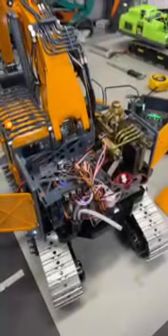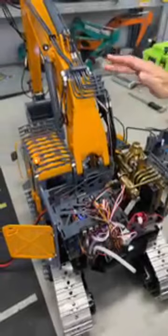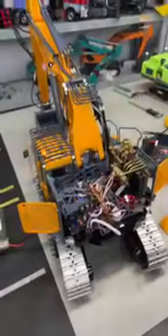Okay, let's see others. The rotation, all the electronics is under this plate. So it is only the ESC. And we have one fan here for cooling it, also one fan here for cooling. Most importantly, what gets hot is the ESC. It needs to be well cooled. For all this pump oil system, if with a cooler, the pump motor and pump will not get hot. Only warming up a little is good enough for the system. So most importantly, cool down the ESC.